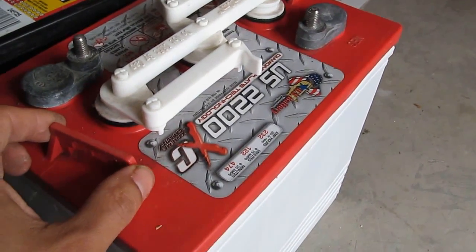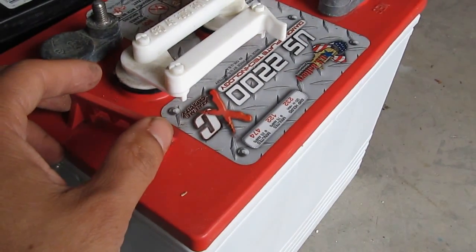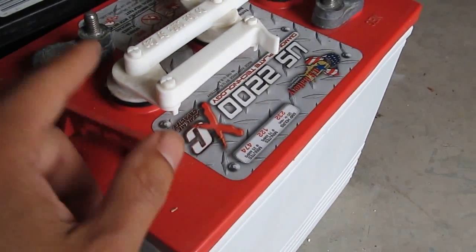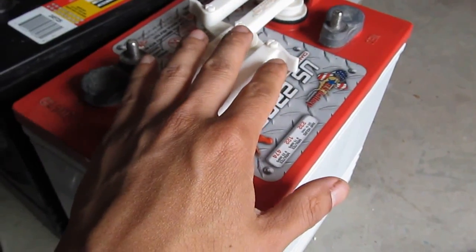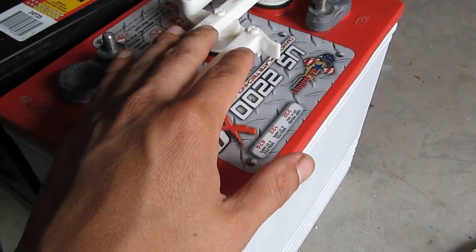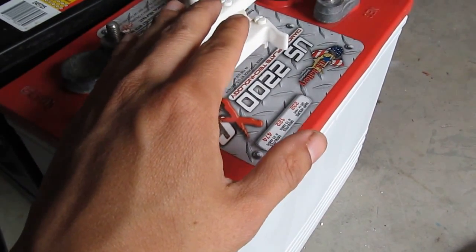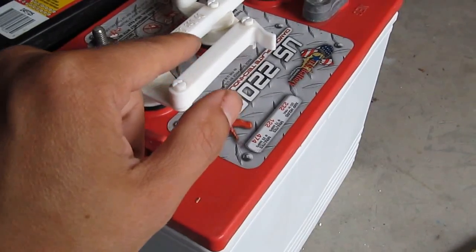So in order for the chemical reaction to occur efficiently, it has to be at room temperature, or a little bit warmer. If it gets cold, the chemical reaction will occur, but it does not occur readily. It is really slow. Say you have a kilowatt hour of energy in this battery at full charge. When it's very cold, you will not get a kilowatt hour out of this battery, probably half of that, and you can only get that much out of it at that certain temperature. In order to get more energy out of the battery, you will need to heat it up to a higher temperature to get more juice out of it.